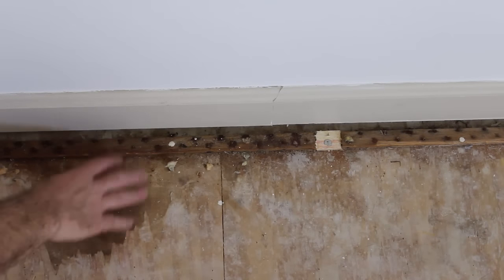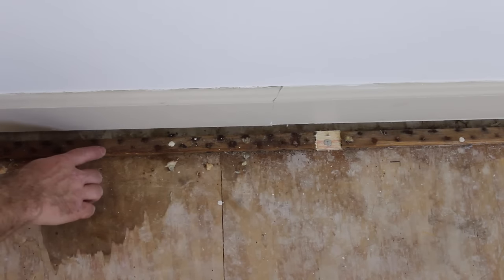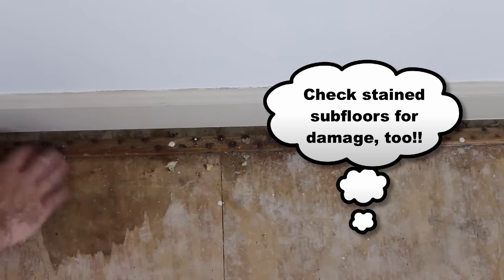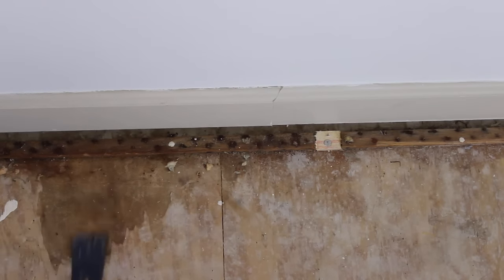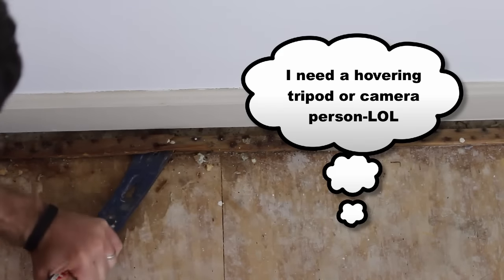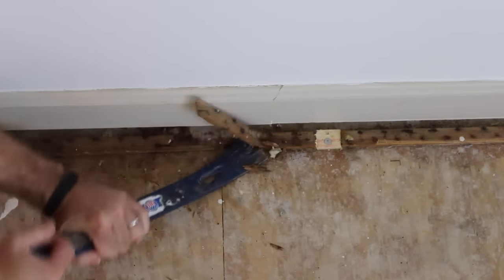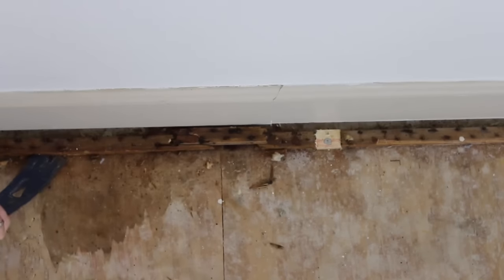If you're going to install hardwood floors, laminate, or anything other than carpet, you need to remove these tack strips. But if you're going to have carpet down, just leave them in place. The one caveat is you need to inspect them — if they're rusted out, that's an indicator that maybe you had a roof leak or somebody spilled water, and that caused the rust. Remove all rusted-out tack strips and replace them with new ones. Take a pry bar, shove it underneath, find those nails that hold it in place, slide the pry bar underneath, and go to town.